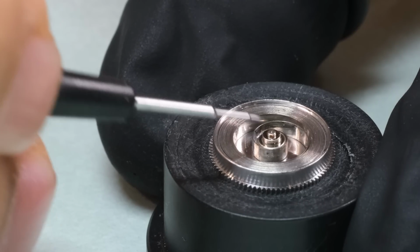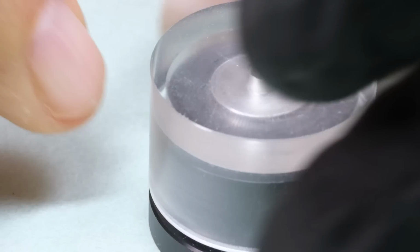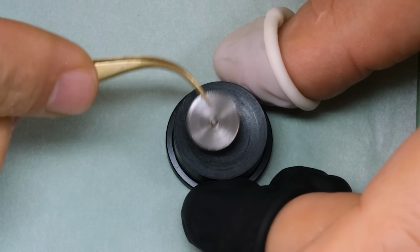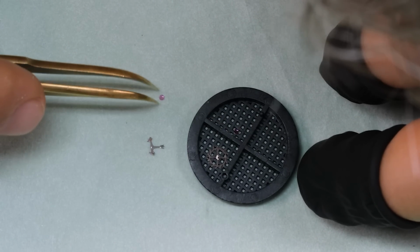So after we got the mainspring back into the barrel, we put the lid back on and then we press the lid tightly shut. Snap! And every time we rotate that arbor in the center of the mainspring there, we coil the mainspring up and thus store power.